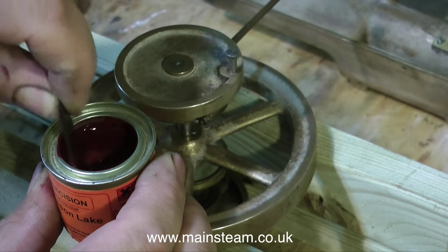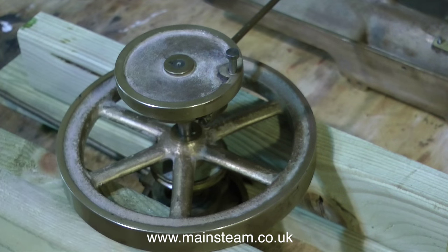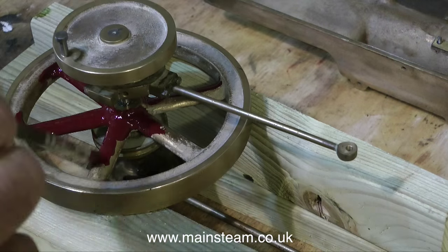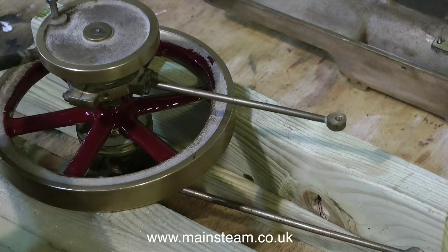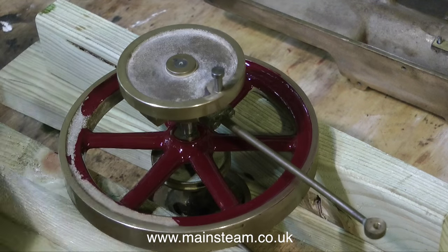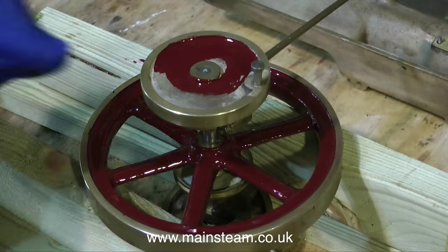Before starting the painting process, always stir the contents of the paint very thoroughly and then apply it. Painting a model steam engine seems to be a bit of an art in itself and I'm no real expert in this field. I should really use etch primer but in reality I seldom do. The best paint I've ever used on an engine was some two-pack, but it doesn't brush very well and if you spray it you need breathing apparatus — it's wholly impractical.